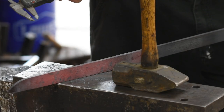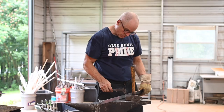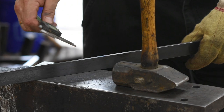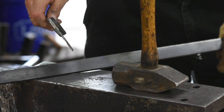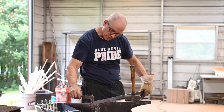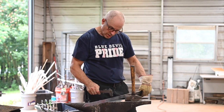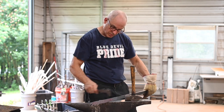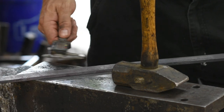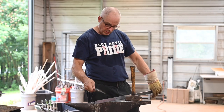I've got two pairs of calipers — these are dead — so I'm using a little measure. I've set them at the width of the stock, tightened the set screw, and as I slide them down I can see where it starts to narrow and where it's still the same width. On the second pass I'm slowly moving up, trying to lay in that distal taper, and this is the way I check it.